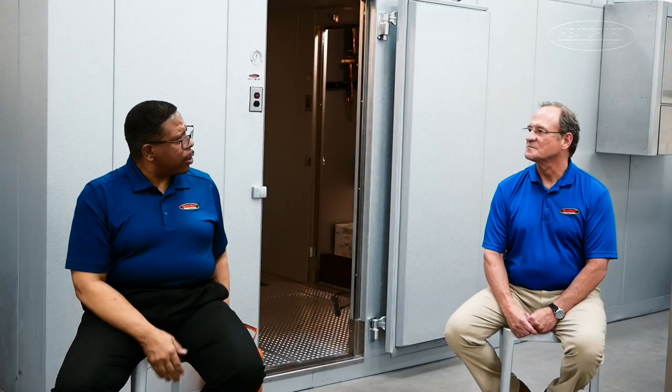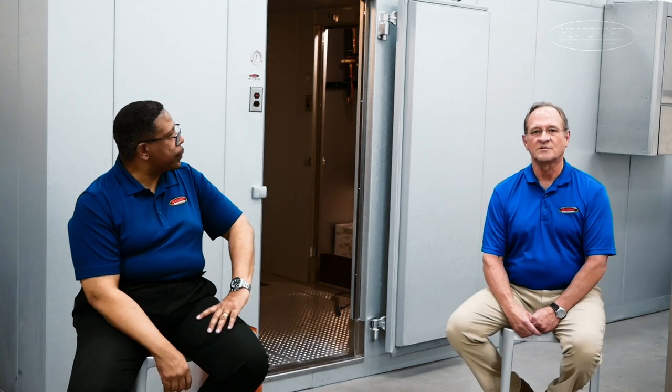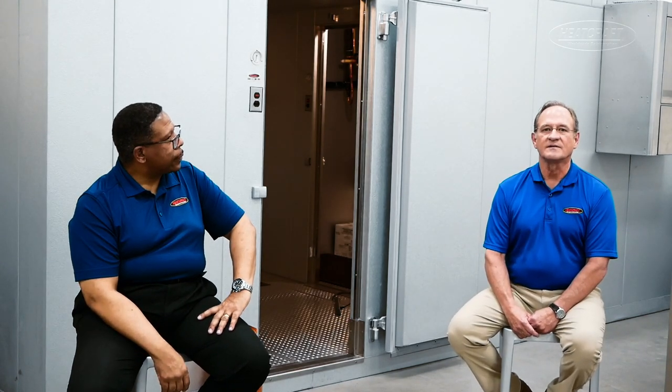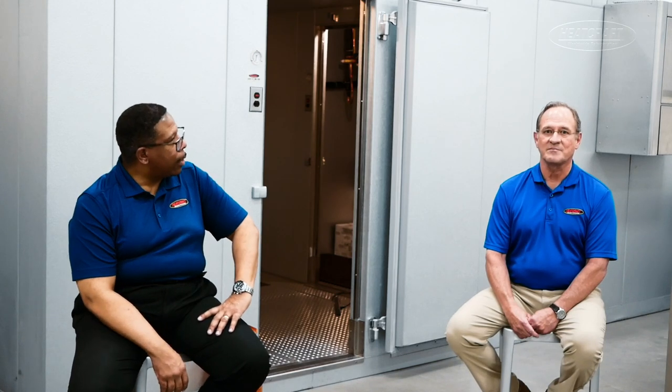Robert, what are some things you're looking for? First of all, low superheat can be detrimental to any refrigeration system. You'll have a liquid flood back or oil wash that could kill any refrigeration system. With our electronic boards and getting these handy low superheat error codes, it really protects our equipment in an effort to shut it down before any further damage can happen.